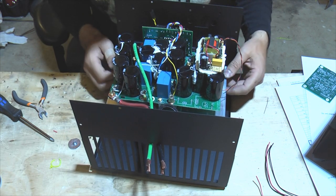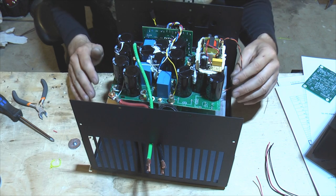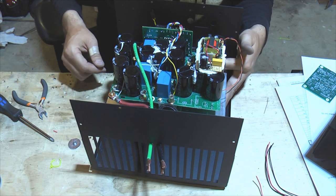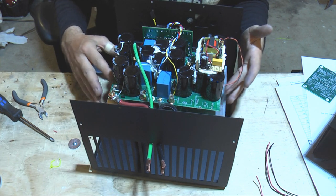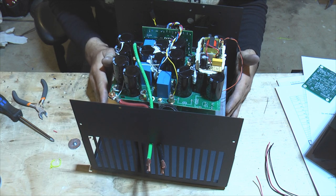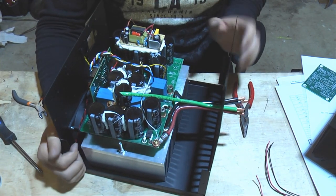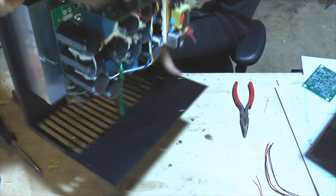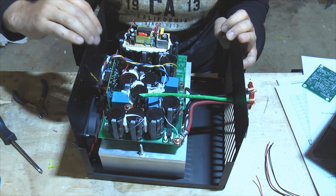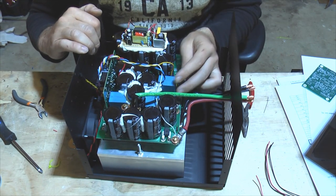In terms of sequence, you could mount the heatsink before mounting the power board onto it, but we tried both ways — it's actually more complicated because you need to apply thermal grease and see where the bolts go that mount the power board. So this is the easiest procedure we found. The heatsink is now completely mounted and everything is solid. Things are a little tight between the driver board and the wall where we'll also be mounting the control board — it's okay to bend things slightly outward since they'll spring back when screwed together.